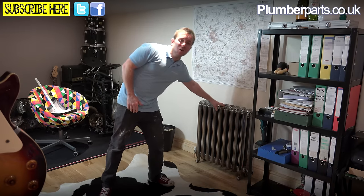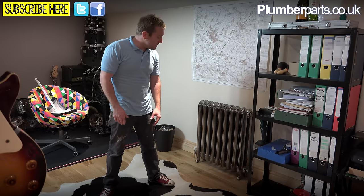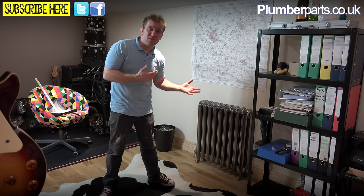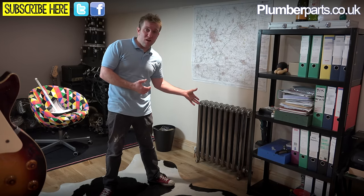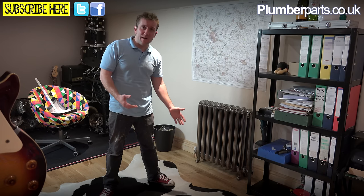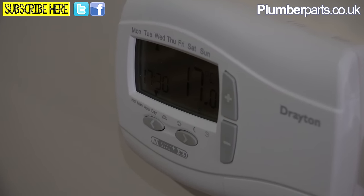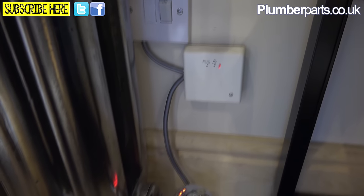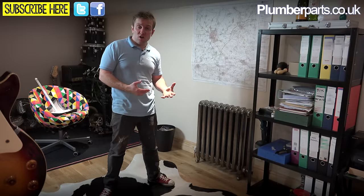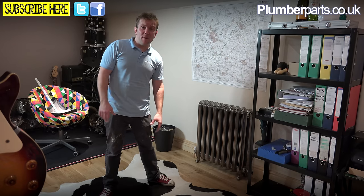It's now getting dark but we're done — the element is installed and working. This radiator is absolutely blazing hot at the moment and doing sterling work taking the chill off. I'm really pleased with it. This video gives you a better idea of how to install an element — normally used in towel rails, but you can install one in this type of column radiator too. The fantastic Drayton Instat 868 is controlling the whole thing, giving us precise control over the temperature and the times the towel rail comes on and off. It's especially handy for economy 7 tariffs, giving you close control over electricity use.